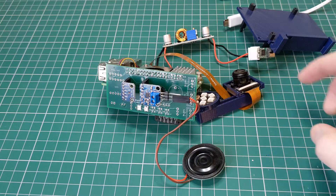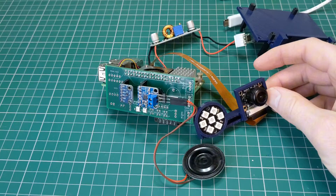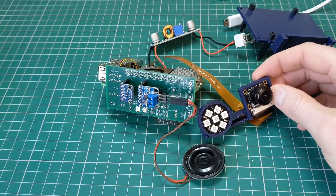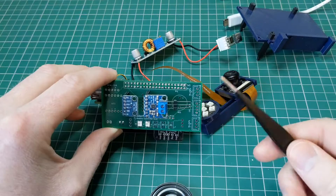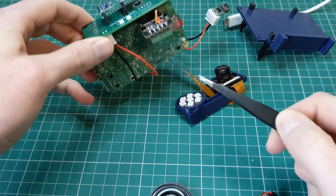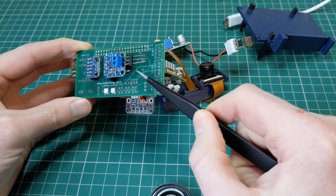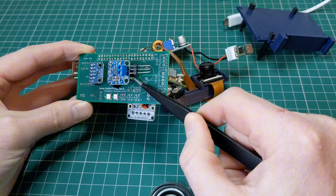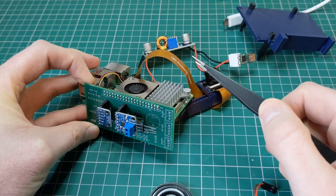Other problems with the Pi 5 and the software: I mentioned in the last video that the camera needs an update for the CSI camera to work. That's not a major problem but it's a little bit of an inconvenience, especially if you don't know it's an issue. For the amplifier, the final version will actually pass the wire through this hole here and underneath the board, and I will have the speaker mounted underneath the board. The hole is actually directly in line with the Raspberry Pi, but fortunately there should be just enough clearance to snake that wire out either underneath or over the top.